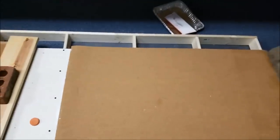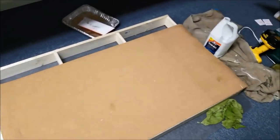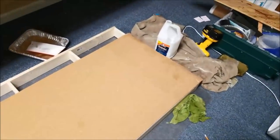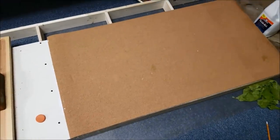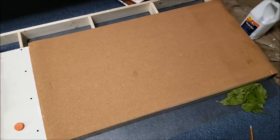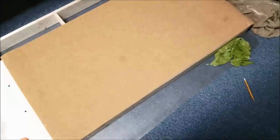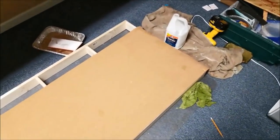We've gotten the cork on the glue. We have a little glue extra on the edge; we're going to wipe that off. The next step is to start clamping. First thing I've got to do before I clamp is put wax paper on this — put something between your boards and the cork. Otherwise you're going to come back and find out the glue came up through the cork and your boards are glued to the cork. Makes a grand mess. Lesson learned the hard way.